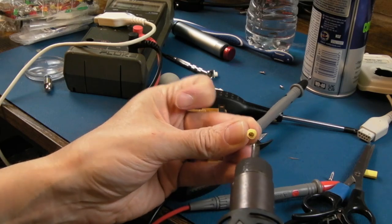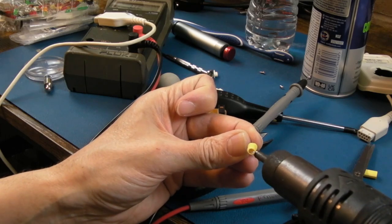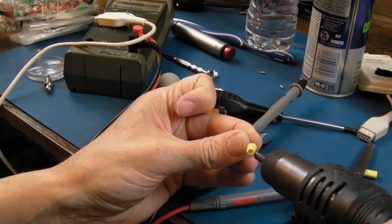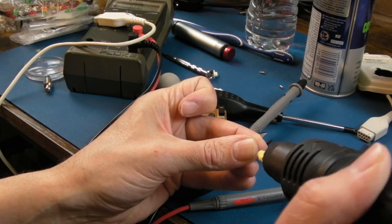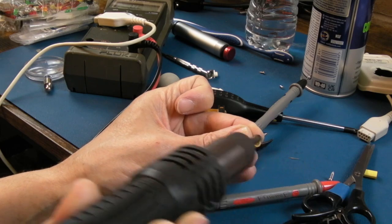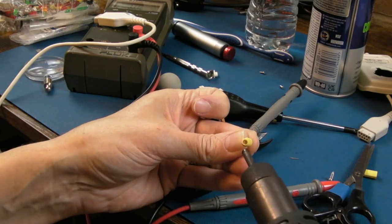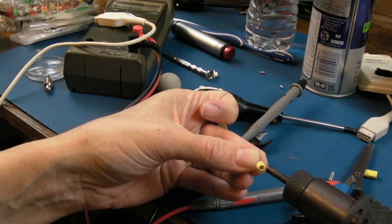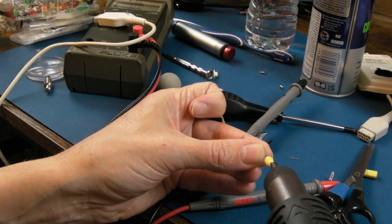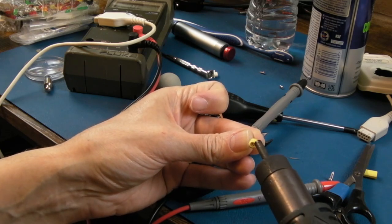And this is the thing now, see, look, if we shrink here, the front, it's going to make a nice little point on the front of it to try and help diffuse the light, so that hopefully this LED won't illuminate the whole inside of the mouse with scattered IR. I think that's going to do the job, but we may just need to cover further there, because the heat shrink on its own at the front might not be focused enough to a point.